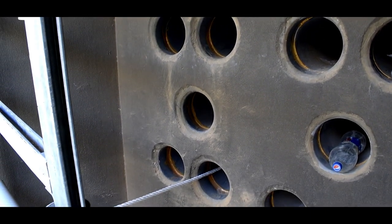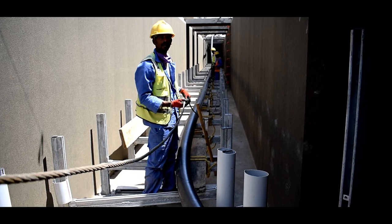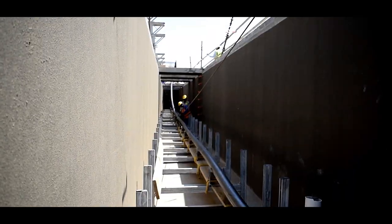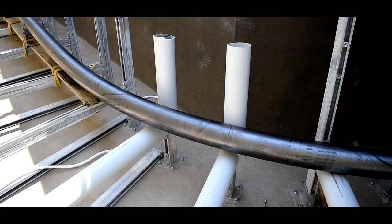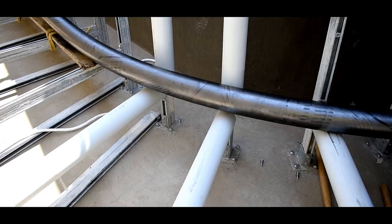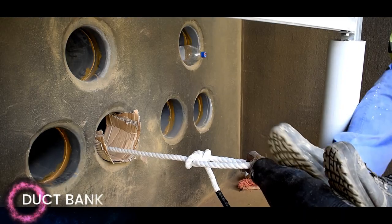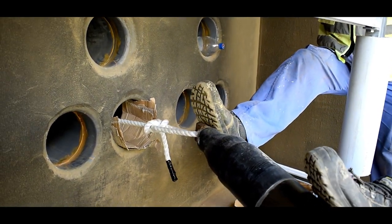Bending of power cable at a short radius may damage the insulation, shielding or jacket of the cable. Therefore, during cable installations, care must be taken that no sharp bends or sharp twists are made. Whenever a bend in the route is encountered, care shall be taken to ensure that rollers are properly positioned so that the bending radius of the cable is always more than the minimum allowable bending radius.